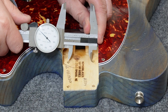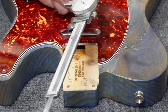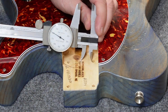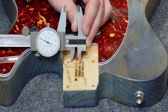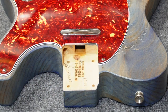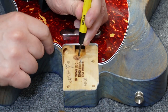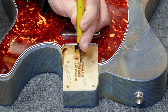Here's the neck pocket of the body we're working on today. I'm going to find the edges of the two holes on the inside — measuring about 1.36 inches — so we need half of that, which is 0.68 inches. I'll mark that with a pencil, then establish a straight line between the two holes and use a punch to make a starter divot exactly at that center point.